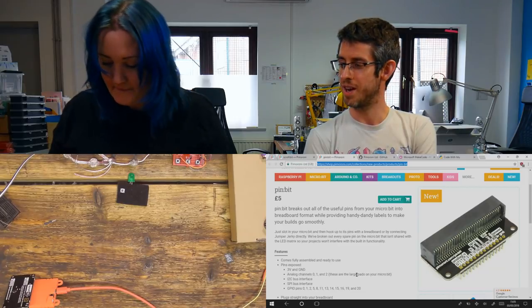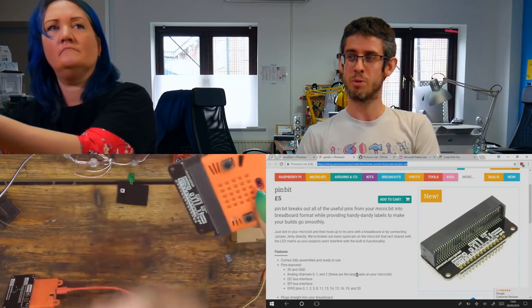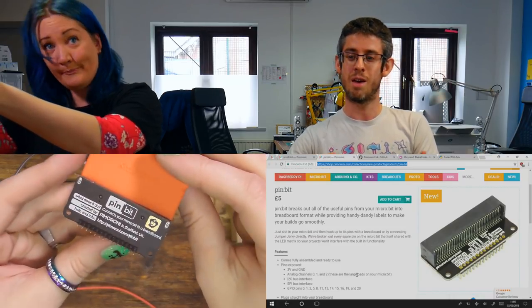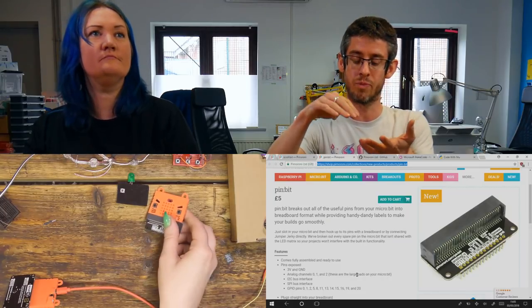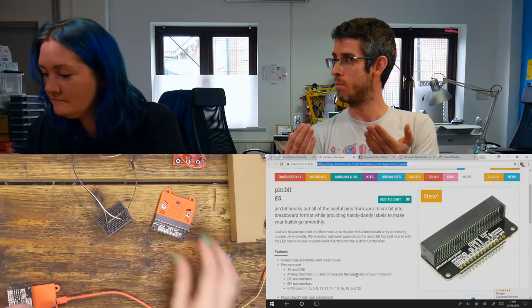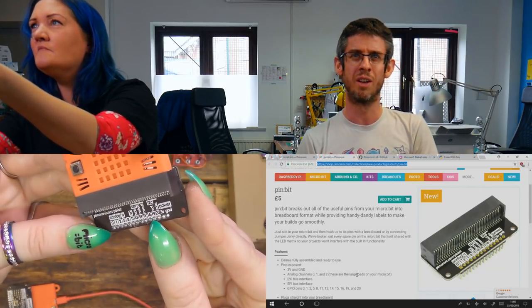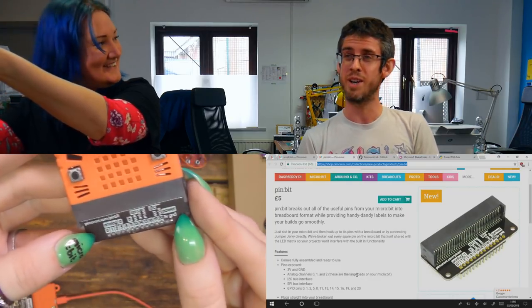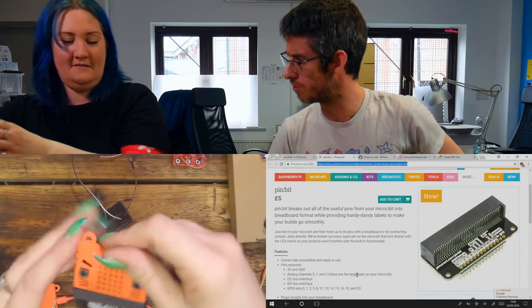That's great. The kind of nerdy thing about this is we're using a thing called intrusive reflow, I believe. Basically the stainless steel stencil for the PCBs has cutouts for where the header pin holes are, and solder paste gets pasted into those holes, then the pins get inserted after the pick and place has been done. I guess that must be how it's done. Anyway, it's quite nifty. And putting it on and off is really easy. It looks incredibly neat as well, the soldering on it.